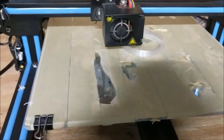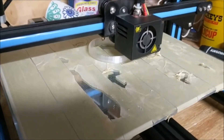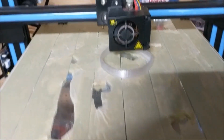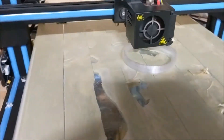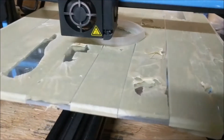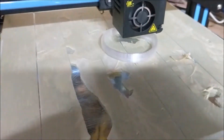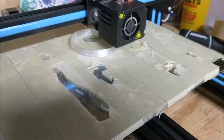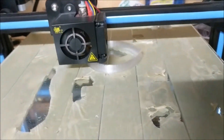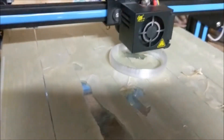So first and foremost, please don't mind the mangled tape on my bed. This is all on a stock CR-10 — well, it's not fully stock, I have a 0.6 millimeter nozzle upgrade on there. And it's printing really really nicely at a 0.2 millimeter layer height. I have not messed with any settings on the machine itself, all I did was mess with the slicer, and I'll give you guys those settings in a little bit. Man, that is looking really really nice.